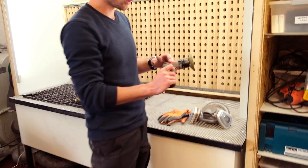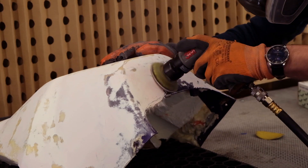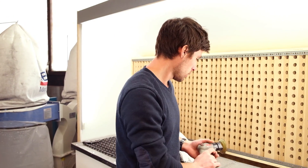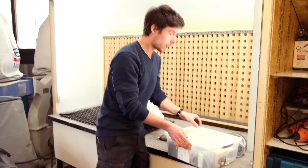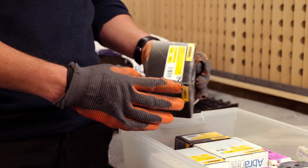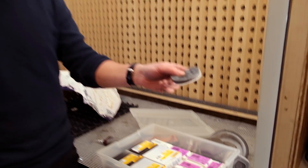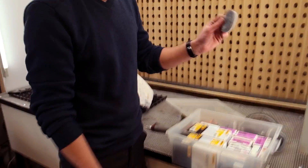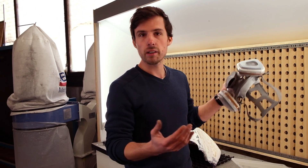For the tools, I'll be using a 3M rotary tool — this is the 75mm model. I like it because it's quite small to get into all the details, and it's air-powered, just to avoid problems with electric parts. I've used two brands of sanding paper — I'm now switching more to Mirka, which is very good for abrasives and polishing compounds. 3M is good as well but a bit more expensive. This is a soft pad for more complex shapes. Always wear safety goggles and a proper mask — not the cheap dust masks.